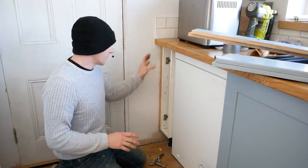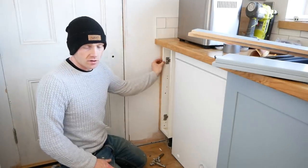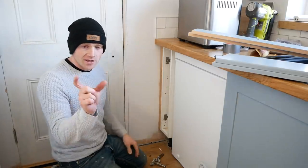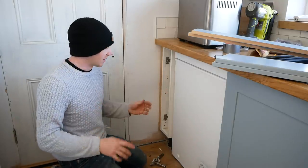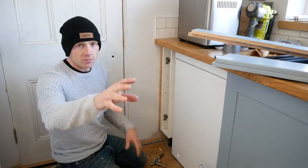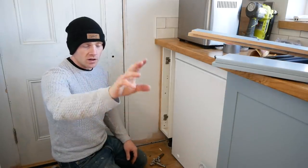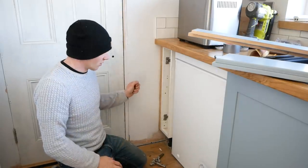The problem I was facing is this is a 150mm unit. By the time you take away the two sides, if I build a wooden plywood or MDF pull out, you actually end up with a very, very thin storage space. Fine for little jars and spices, but out here where we've got detergents that are going to be used next to the laundry area, it really needs to be one of the wire racks which we've used in the kitchen. So I've ordered one of those for over on that end, but here, like I say, we'll keep it simple, just put a little hinge door on here.